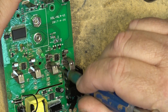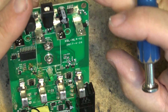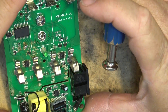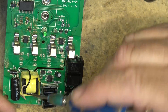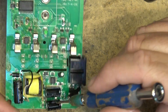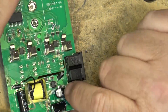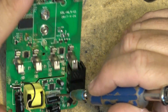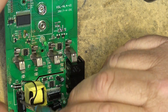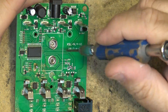I don't know why this looks like it has corrosion — it almost looks like this thing has had moisture on it, either from shipping or just sitting around. But it appears to work. The AC side is fused, and there are filter caps for the raw AC side: 4.7 microfarad 400 volt on both positions. Here's the switching IC, with MOSFETs driving a small transformer. On the low voltage side there's a rectifier on the DC side, which powers the charge controller IC and the four charge circuits plus the 9 volt circuit.